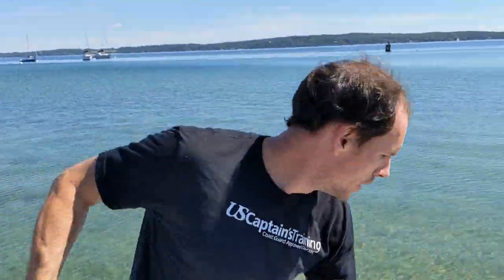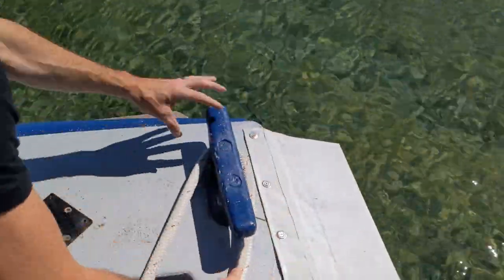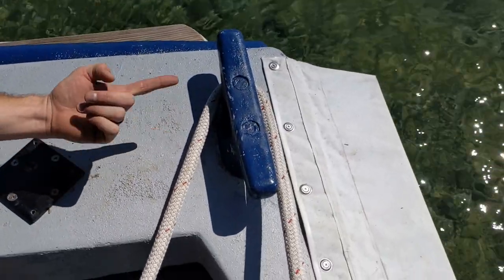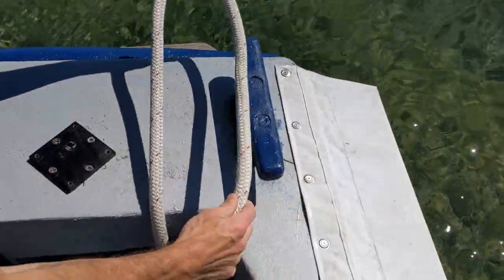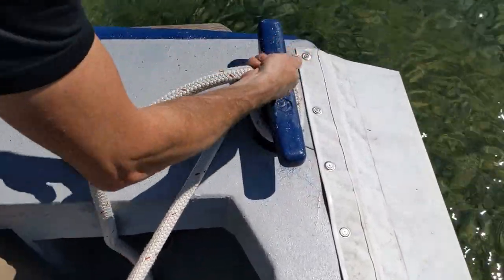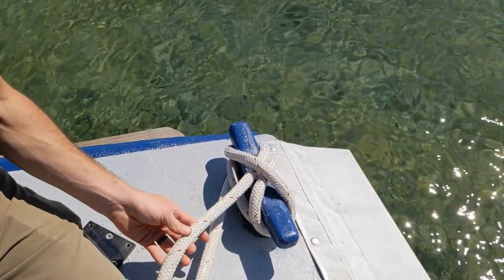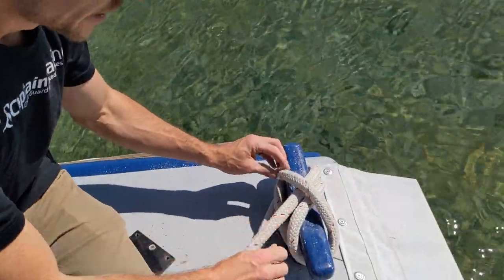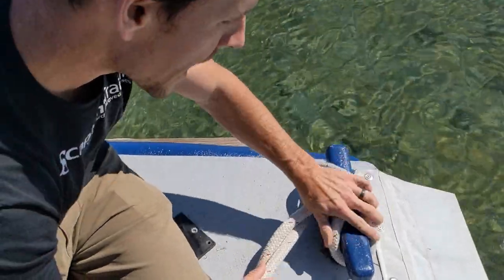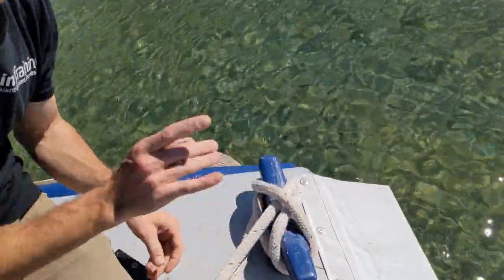The cleat hitch. Let's take a deep dive into the cleat hitch — two different types. The first type is what you'll usually see. You approach the back side of the cleat; this angle needs to be the sharpest angle you can make. Go around this way, do at least the 360, then around and lock it. Now here's the problem: if there's a very high static load on this, something's pulling very hard consistently and you try to unlock it, the force will actually just take up the slack and keep it locked. You don't want to put your fingers in there with a high load. So let's look at a solution.